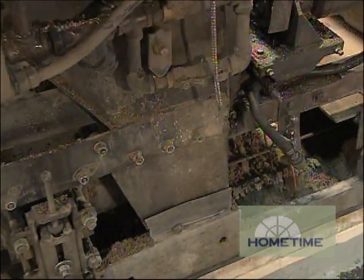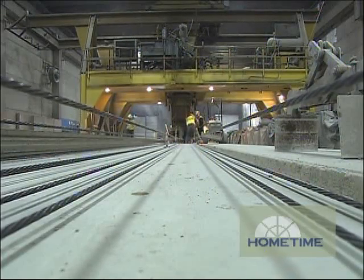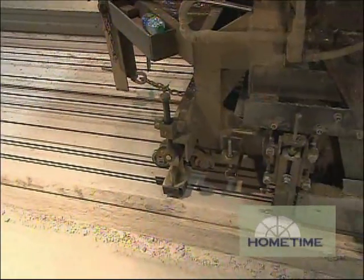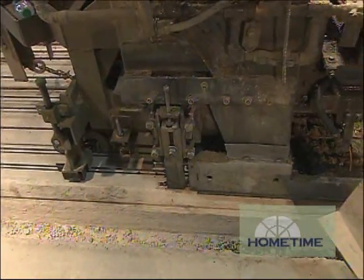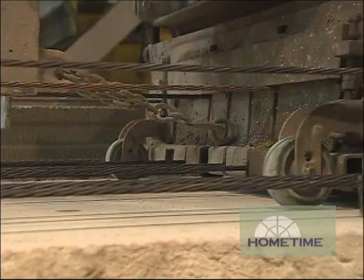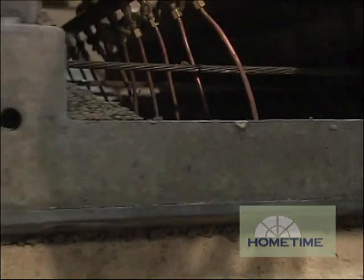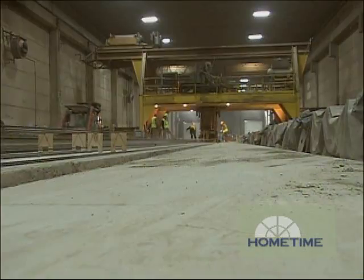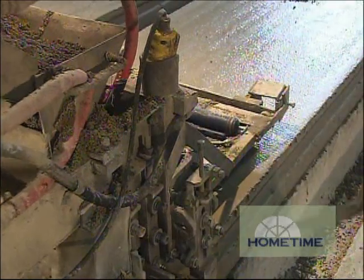It lays out one bed that's 600 feet long, and this is also pre-stressed — it has cables in tension so you're building that same sort of tension into the final product. We'll take a 600-foot long bed and tension it full length with cables. There are bulkheads at each end — they'll put a buckle on one end, stretch it to about 70% of its ultimate strength, and couple it on the other end. Then the hollow core machine comes along and the gantry system moves it right along the 600-foot bed — the actual machine that extrudes it moves the full length of the bed.